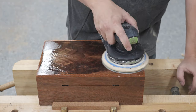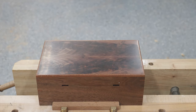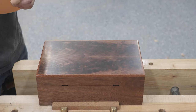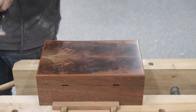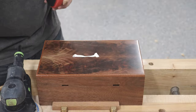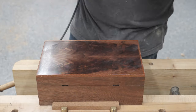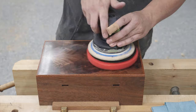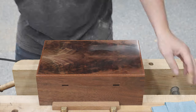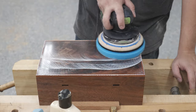I'm always kind of iffy about wet sanding the lacquer — I just prefer not to, but the lacquer, even after curing, likes to clog the sandpaper so I really don't have a choice. I started with 600 grit and moved all the way to 2000 grit, then shifted to the buffing compounds. I'm also making sure to wipe everything off between each grit — you don't want any remaining residue from the previous grit because you'll end up with swirls. Take your time, even more so on the buffing. It's a lot easier to accidentally roll over your edges when you have something squishy beneath you. If you have swirl marks, you won't really notice them until your last step, but if you look at slight angles you will pick them up. So make sure you're paying attention and taking your time — it is imperative.